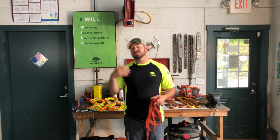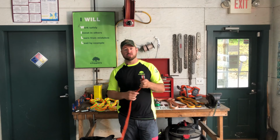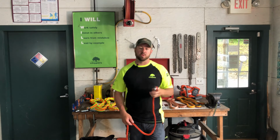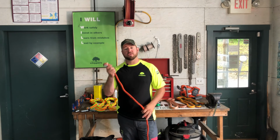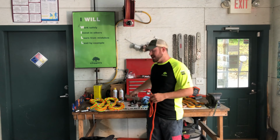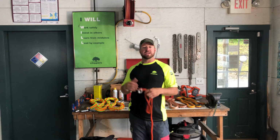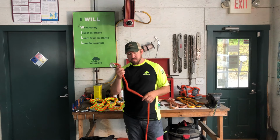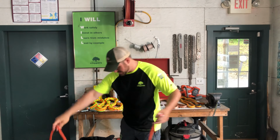The days of wrapping a tree or going through a natural union still occur, but these tools allow you to have a little bit more manageable friction that you have a consistent control over. Most times I teach people with the rigging rings, the ring is worth about a half a turn on a regular large size porta wrap. What I have behind me is actually a small porta wrap. Good for small rigging material, also in tree rigging. The large porta wrap though has a little larger bend radius and a ring's about half a turn on a porta wrap. So this is a dead-eye sling.